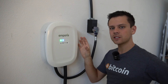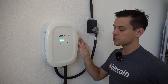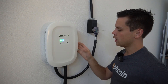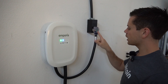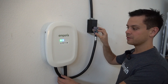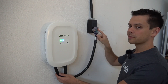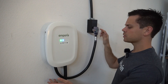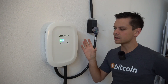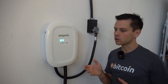This charger was very easy to install and I absolutely recommend it for beginners — it was much easier to install than the 50-amp Level 2 Tesla charger. For me it took a little bit longer because I had to add this plug. It previously had a NEMA 14-50, which a lot of people use for Level 2 charging, but I prefer the NEMA 6-50. It has one less conductor, it's easy to wire up on the terminals, and I can still charge my Tesla and other EVs.